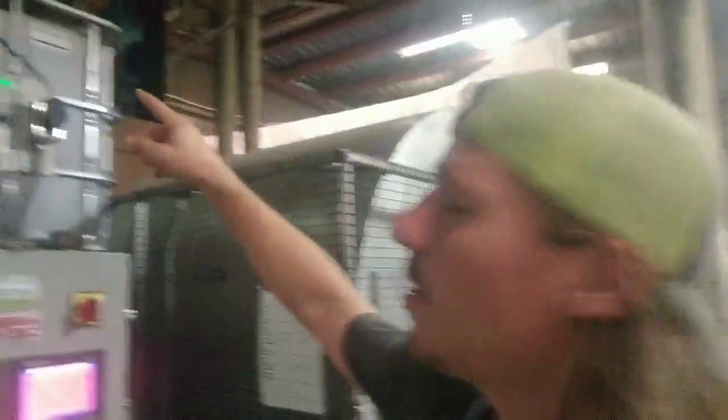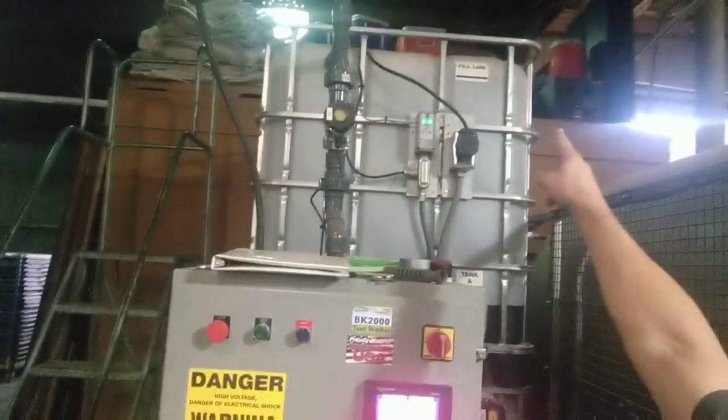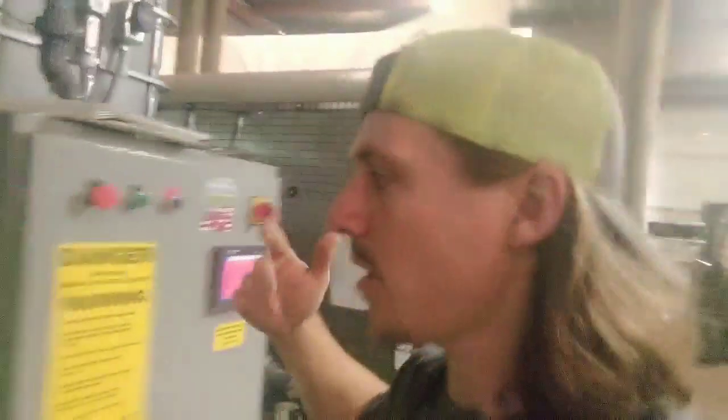Before you go home for the night, make sure that tank is filled up. If it's not, depending on the temperature of the day, you'll be waiting two to three hours to get it to the right temperature. As you can see now, we are at 104 degrees, so we're good to go. Also make sure the fill line is still at the very top. I am filling the bottom tank now and it's now full, so I go ahead and turn the water off. This washer is very movable and transportable — I don't have it plumbed in at all, I just use a water hose and switch from tank to tank. They do have a water hose latch on the back where you can screw the hose in if you need to walk off for a while.